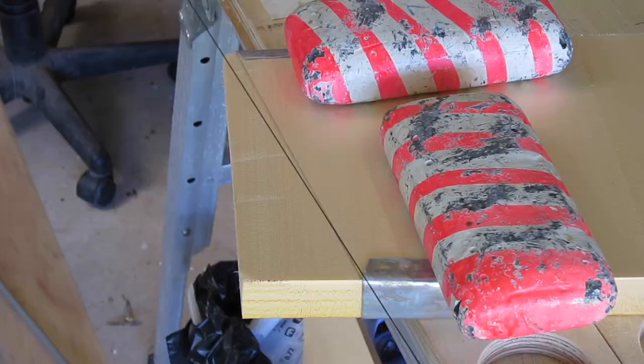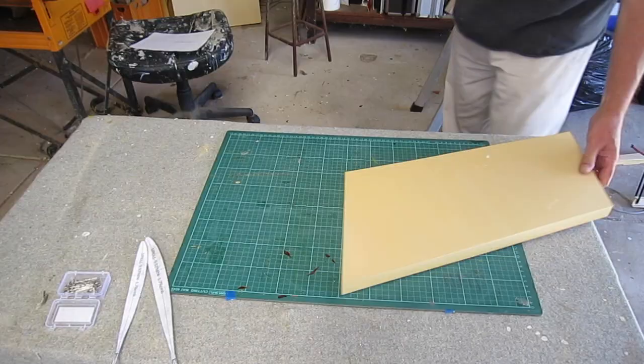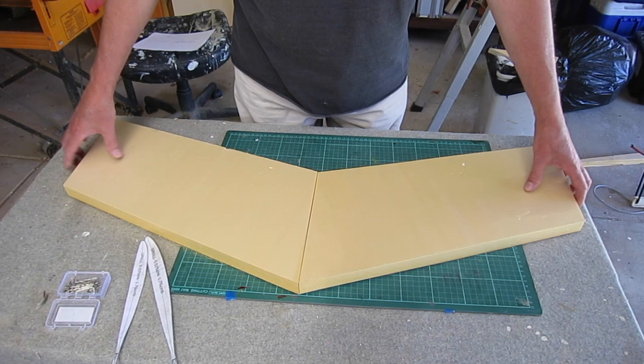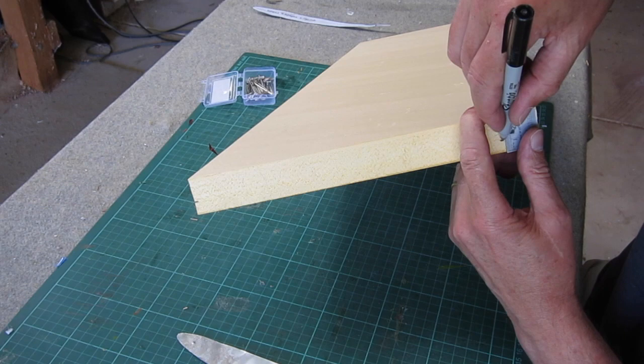The aluminium is very thin and flexible — I think it's window flashing or something like that — but it's the same stuff that I use for cutting out the actual airfoil templates and can easily be cut with a pair of scissors. The wing cord at the centre is 250mm tapering down to 210mm at the tips, and I have a 22.5 degree angle for each wing half at the nose.